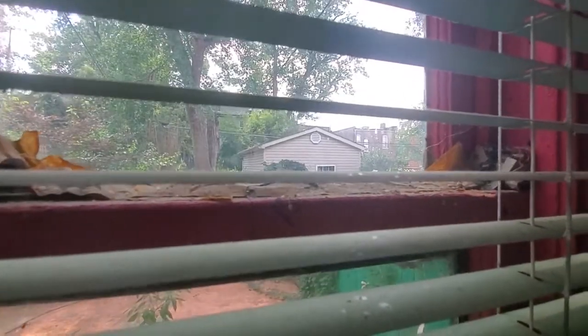You've got a little brick entryway and a big tree that probably needs to come down. It's a maple, it's already split; one half has come down at some point. As you can see, this green fence is pretty much what your yard is. It's a concrete pad directly in the back, and it looks like it swales towards the house, not a good thing. Your electric lines are clear, but again, that's a big tree with a lot of dead limbs. I would budget to have that taken down, and that's going to be expensive.